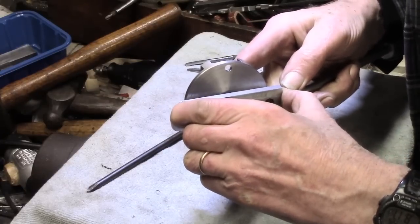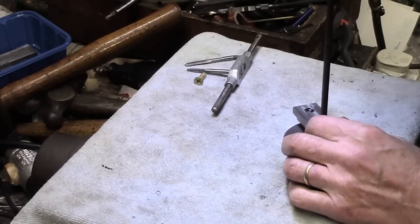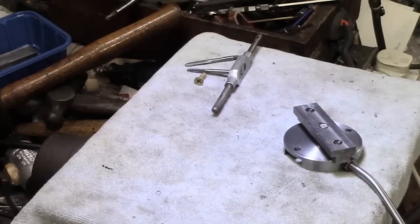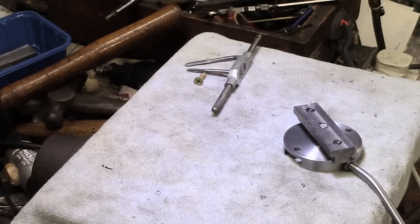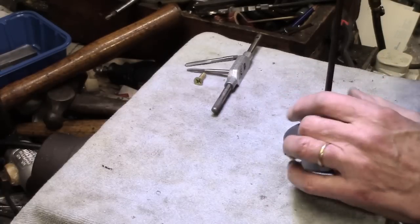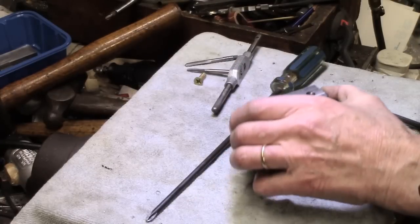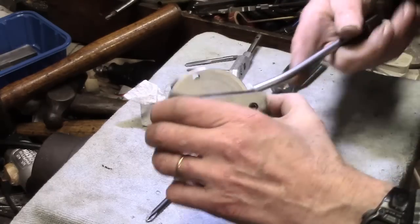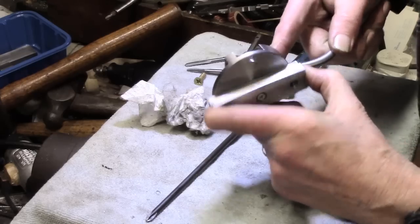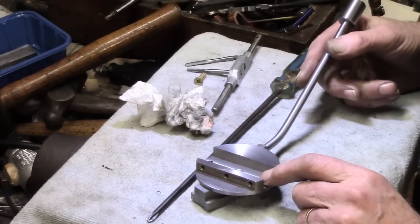There's still a little bit of movement. I've got the right screwdriver for that — it's a posidrive screw, which in the UK is actually a very good system. Let's tighten that up a little bit more and get a little bit of oil down those cuts. I'll put it in the tool post and see — I think there's a slight improvement, but I may not go much further on this except when I get a suitable drill so I can drill an HSS bit.